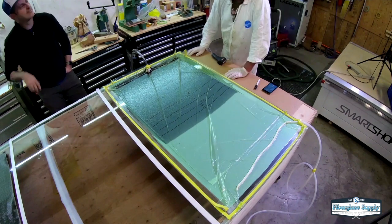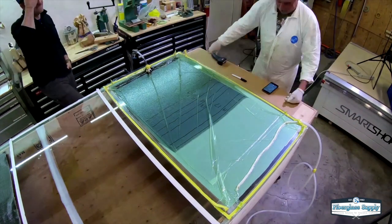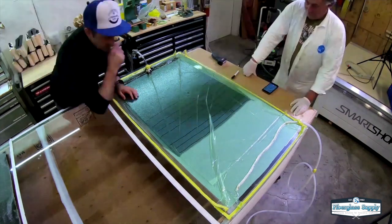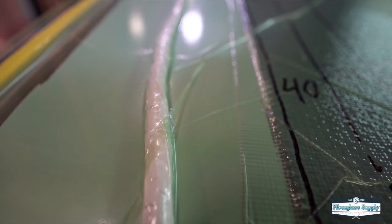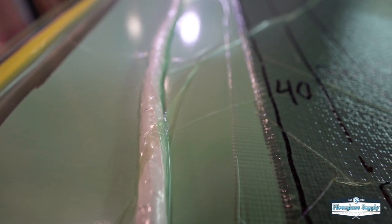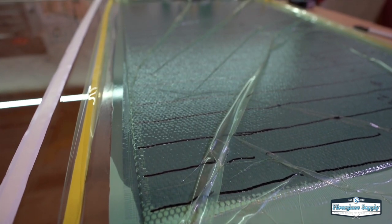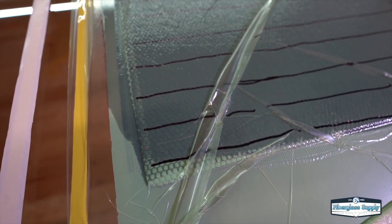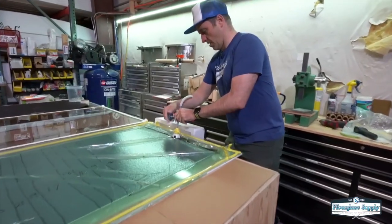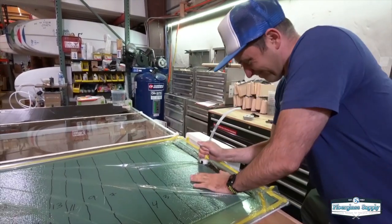Here's a hyperlapse of that panel filling — right there we're at 17 minutes, 19 minutes, 21 minutes. It's filling slow, and slow is not necessarily bad, because we've found over time that especially on carbon, filling slow gives us better surface cosmetics. We want those nice surface cosmetics and don't want pitting at the surface.